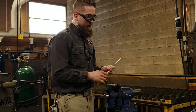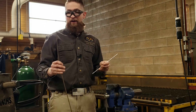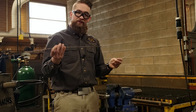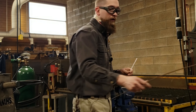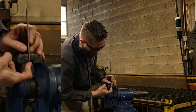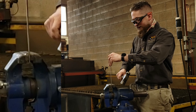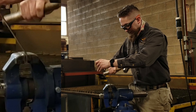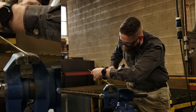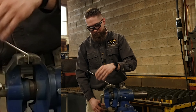Next we need to bend the hooks for the coat rack. If you have a larger piece that's fine - I have some cut about three feet already and cut a smaller chunk. It's a little easier with the leverage of a longer piece, but with a hammer you can make this work. I usually clamp this in right past the jaws so I've got about an inch or so down in there, tighten it, and we're just going to lightly tap this over.